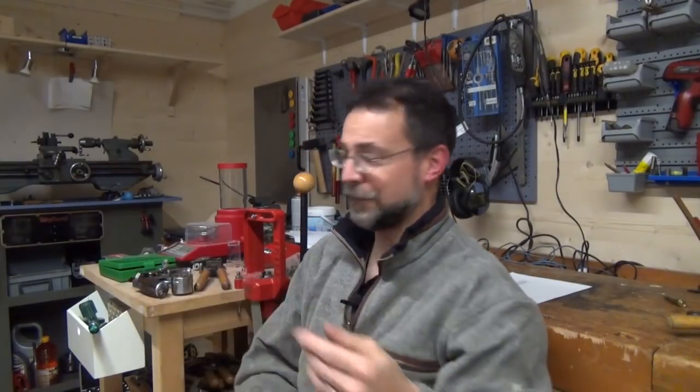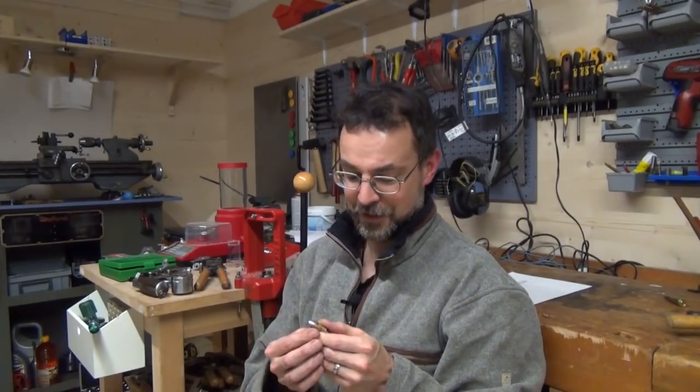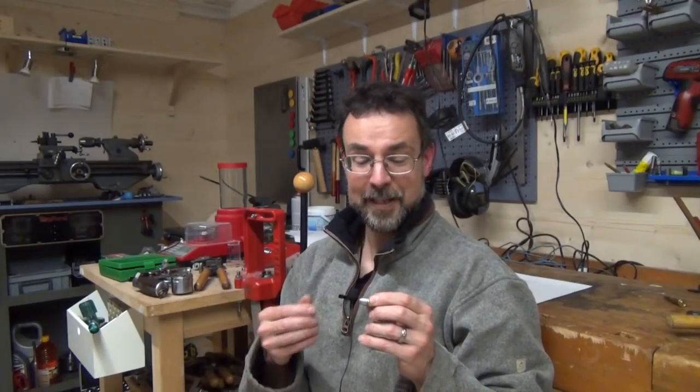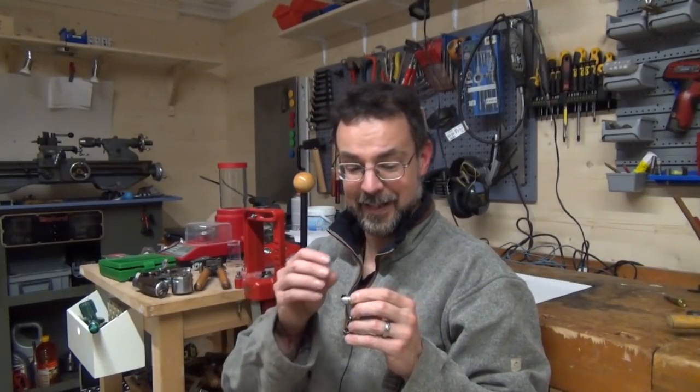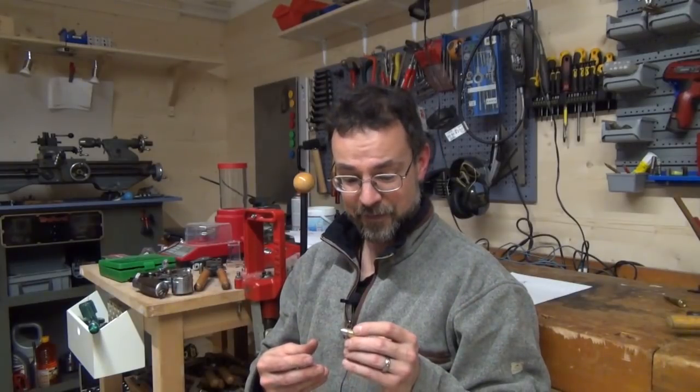And the first pattern of cartridge has a heavily heeled bullet. Now, the result of this is that when you're trying to reload, you end up with a maximum bullet diameter and a case mouth diameter which are identical. And this presents a problem when you're using your conventional reloading dies. I'm using a Lee Precision custom set, CH4D do one as well. But using the conventional crimping methods that we have available, this heeled design presents an amusing problem.